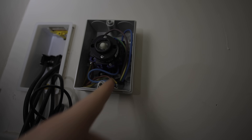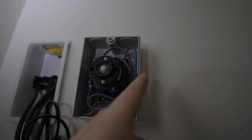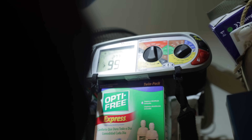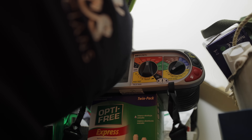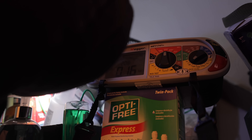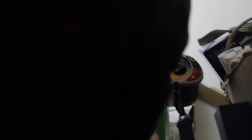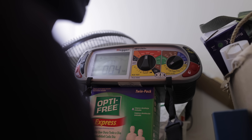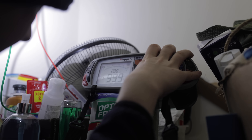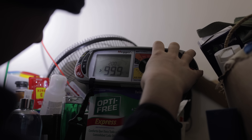We want to test the outgoing cable between line and neutral, line and earth, and neutral and earth. Between earth and live we've got 0.15 — quite low. Earth and neutral: 0.35 — still fairly low. Live and neutral: 0.03 — that is almost a dead short. On the resistance test it's reading greater than 99.9 kilohms, so it's not truly a dead short, but still quite low.